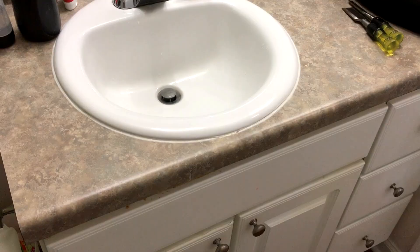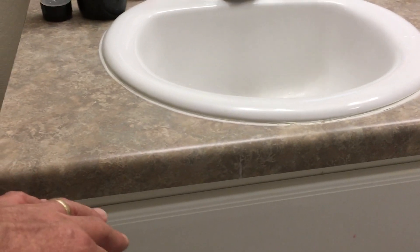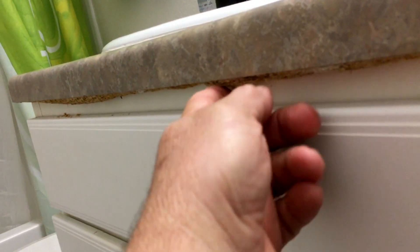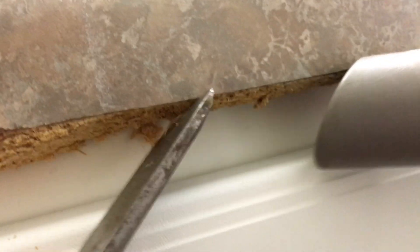What was happening is these upside-down ant hills or mole hills would form as a result of the composite wood swelling — just sawdust glued together. When water gets underneath, it swells up. As we're scraping it away, Wyatt is here to suck it away with the vacuum cleaner, and the big pieces you can stick in the trash.